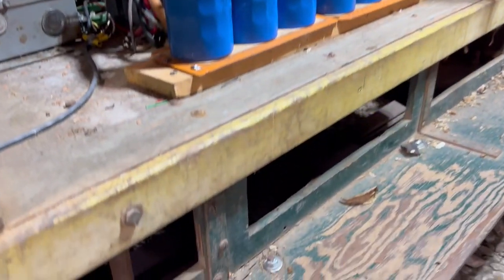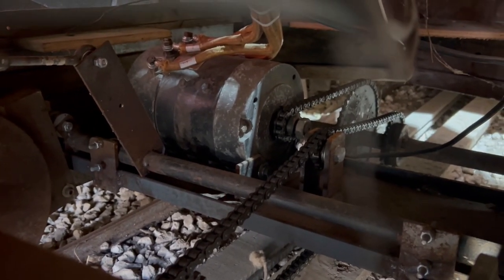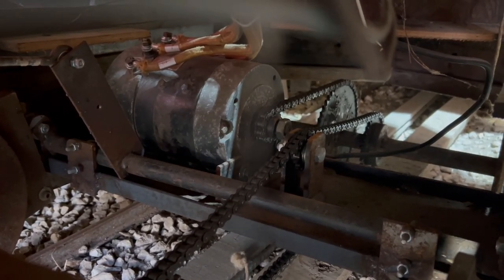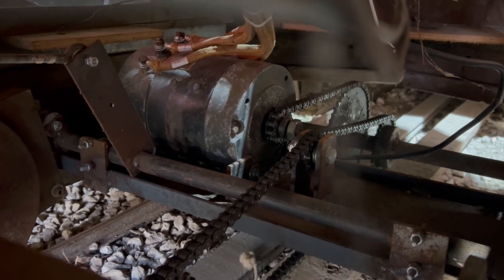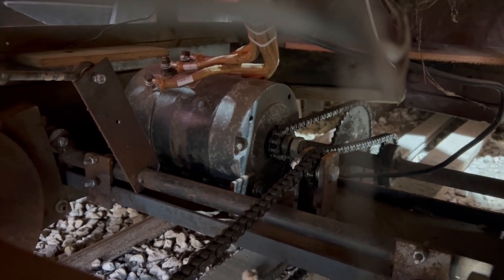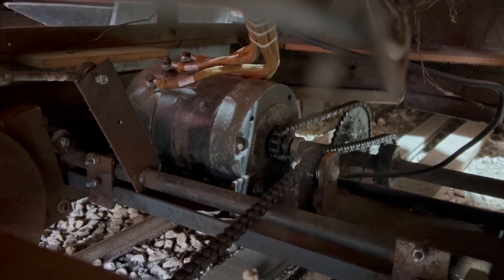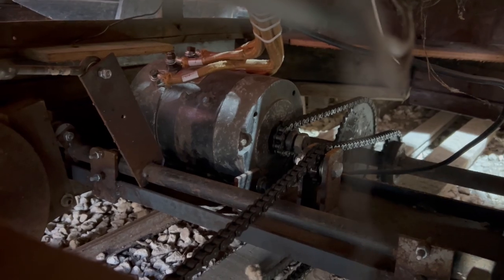This little open car has one motor. Let me get underneath here and show that. That is a 36-volt DC motor from a golf cart or a little industrial cart of some kind. It's a two horsepower motor, and it is series wound. With a series wound motor, you can pretty much develop as much horsepower as you have power, or until it burns up. I use these because they are very capable and we're only using them at a very high power rate for a short period of time, so they last for many, many years. In fact, I've never had one of these motors fail.